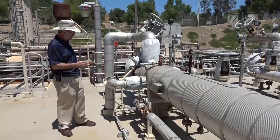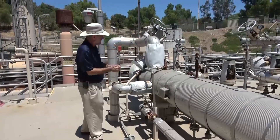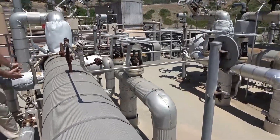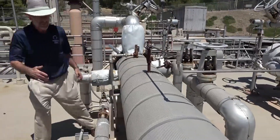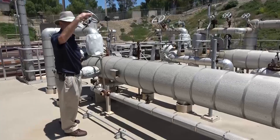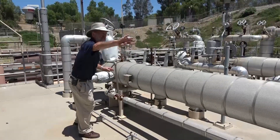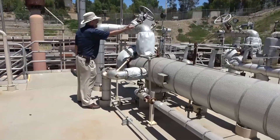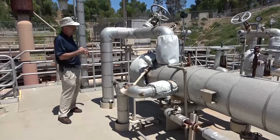The feed water moves in the opposite direction. In many ways this is like a condenser — the steam condensing fills the shell, while feed water is inside tubes. The feed water inlet comes in on the other side, entering the bottom portion inside tubes. Like the condenser, it goes through a tube sheet restricting flow to the bottom half of tubes, travels all the way to the far end, then moves upward through bent tubes in the top half, being heated by the condensing steam. The heated feed water from heater number two then moves to the next higher pressure feed water heater, which is number one.